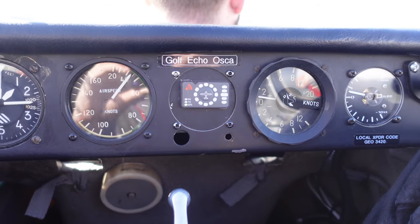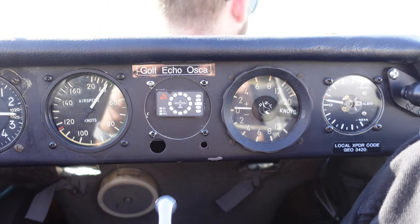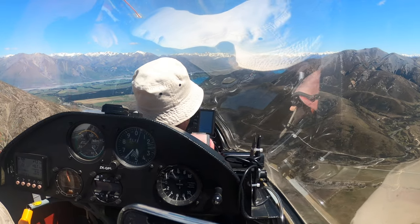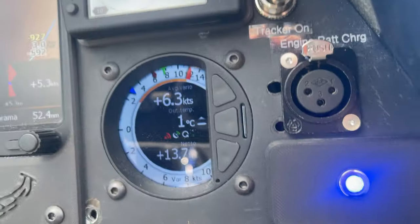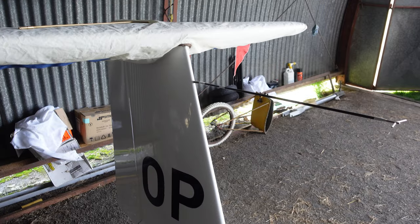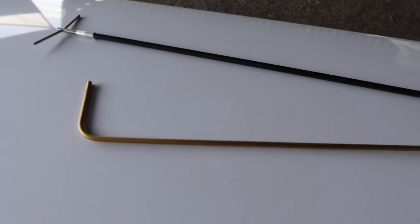So how does Hawk compare to a normal variometer? Let's have a quick walk through existing variometers and how they work. The first is an analog variometer, much like your winter variometer that's included in a lot of gliders. They use a flask under the seat or behind the panel, which works out whether or not the glider is gaining or losing energy. They're analog, they don't make any noises. So the next big upgrade that came along was electronic variometers, which traditionally use a total energy probe just like the analog variometers do.